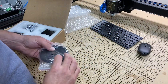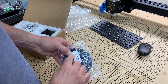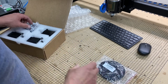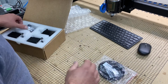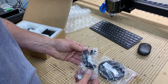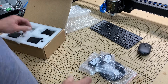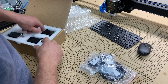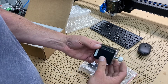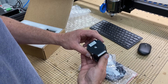This is the belt and motor upgrade. This is 9mm belt — it's a little thicker, 9mm instead of 6mm. There are new clips and new 9mm idler wheels, tension clips for the belt, washers, and the new stepper motors. The larger motor has the 9mm pulley on it.